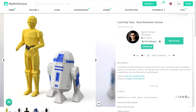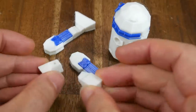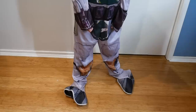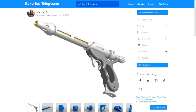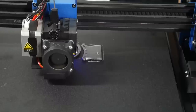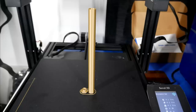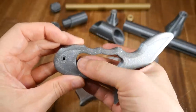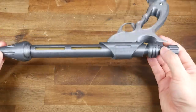To better utilise the filament colours I was using, I switched to these low poly toys. The model seemed to print okay, but when I was trying to assemble it, I realised the layer adhesion was quite poor, which I put down to too low a temperature in the slicer. On to the next test — my son wants to be Boba Fett, but he doesn't have a blaster. Fortunately, Stormtrooper Gaia has provided a nice Django Fett blaster. This is printed in many pieces, and I printed the silver ones on the left hand extruder and the gold ones separately on the right extruder. Some of the pieces are quite tall and skinny, and I'm pleased to say the bed had sufficient grip. They printed quite nicely apart from minimal stringing, but I cleaned that up, assembled the blaster, and the final result is quite nice — with smooth surfaces and nice details.